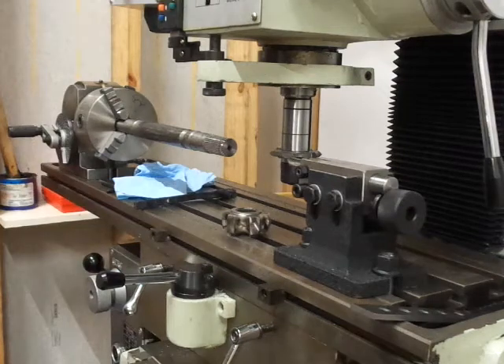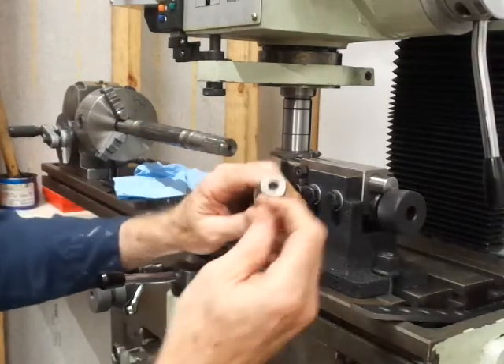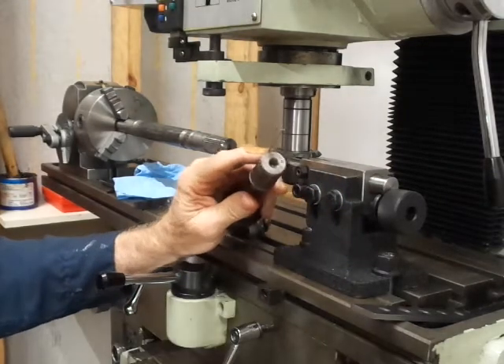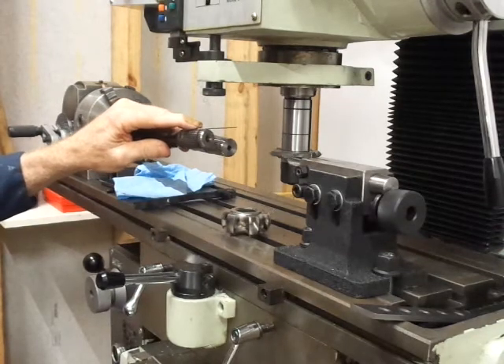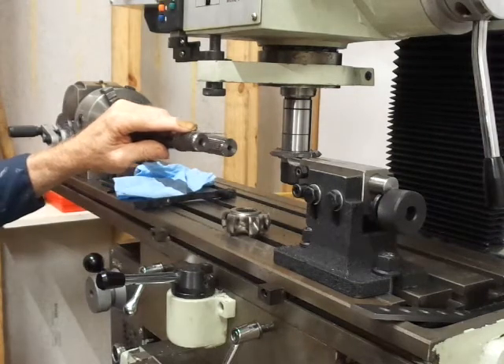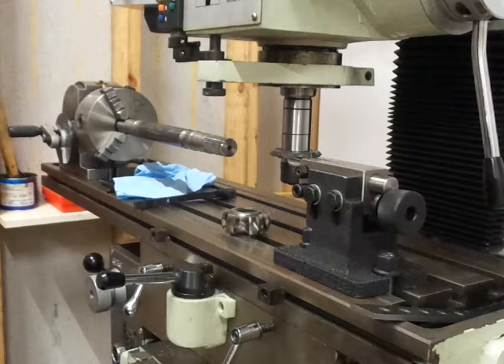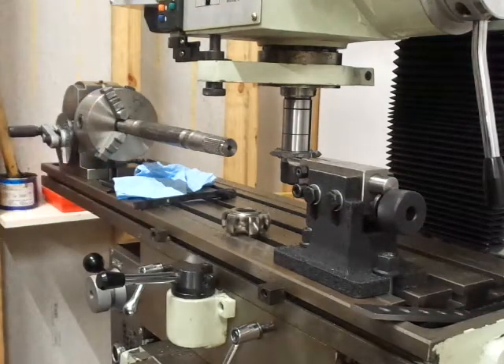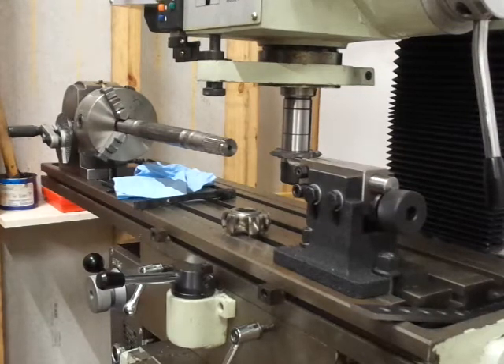It's physics, and it's simple. I have to have things simple to do machine work. I know it's more complicated than this — you know it and I know it's more complicated than this. But you're duplicating everything. When this axle measures .994 with this wire in it, and they're the same diameter to begin with, you know that that groove is the right depth. But this works, and as you think about it, you'll realize how much sense that makes.